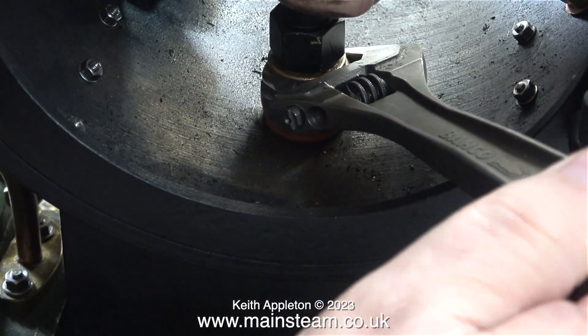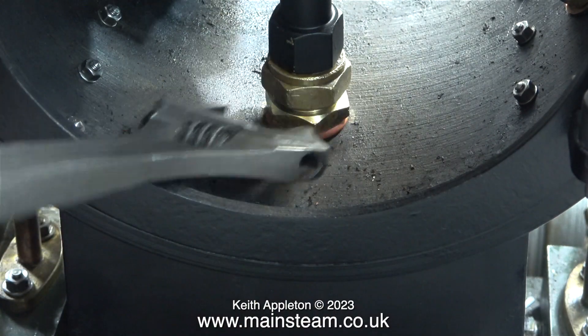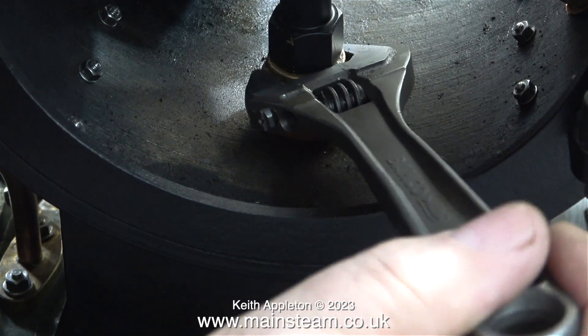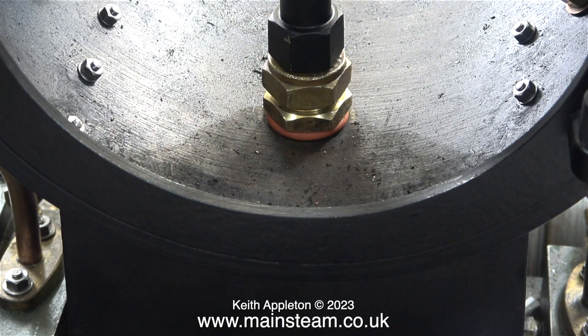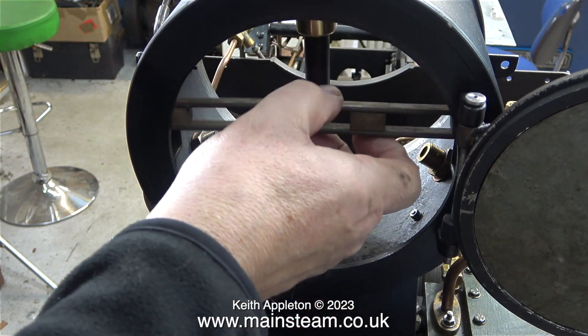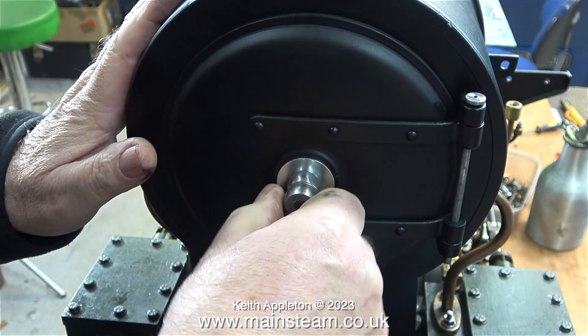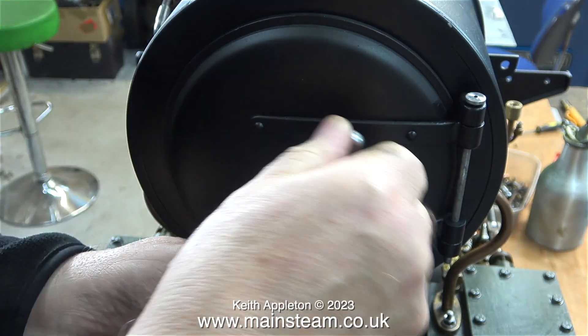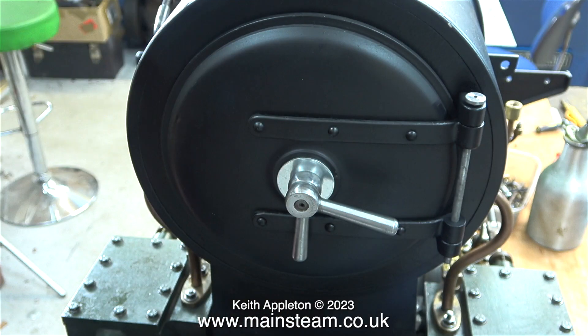I'm finishing the installation by tightening the gland nut to make sure this part is definitely airtight. It's very important that no air from the outside world can leak into the smoke box and destroy the vacuum. And as I refit the smoke box door, you can see how good a fit it is. The smoke box door has to be an airtight seal against the smoke box itself — it reminds me of the lid on a pressure cooker, but in this case it isn't pressure that it's holding back; the smoke box door maintains the vacuum.